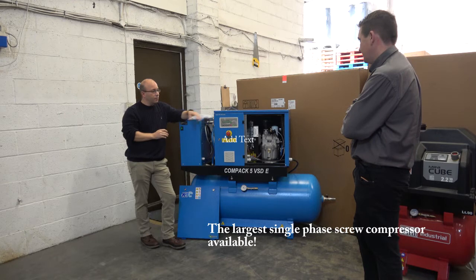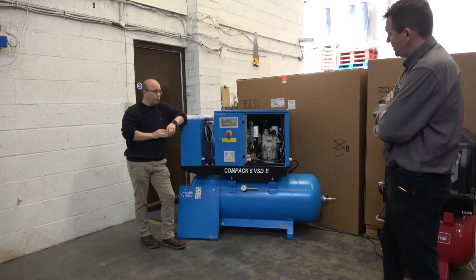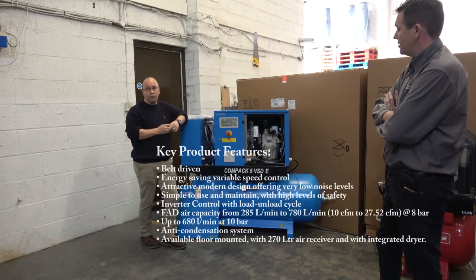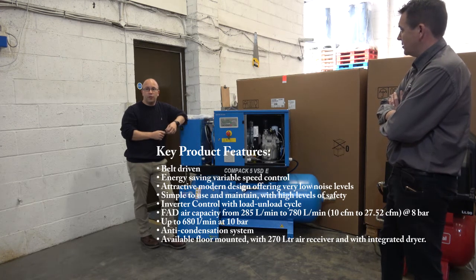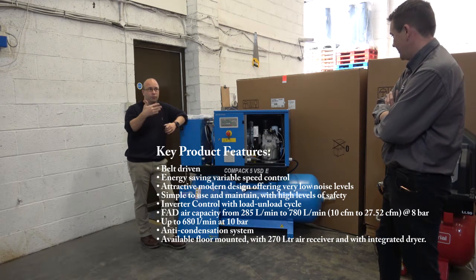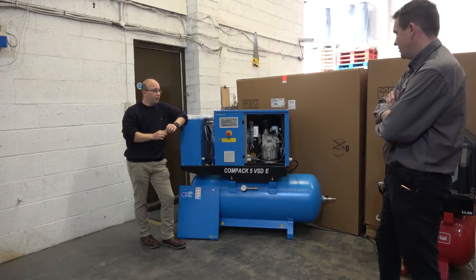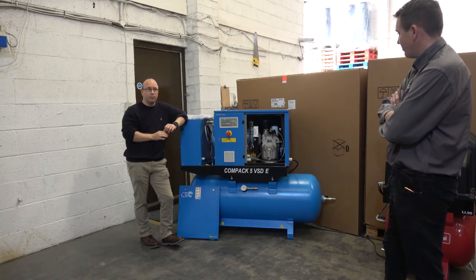It's been reliable so far, no problems at all. The only issues I've come in contact with these machines is where people have not followed the electrical installation guidance we've set out. It's all well and good saying you'll give a 32-amp supply, but if you try to put it down a tiny cable, it's not going to work very well. We set out what size cable needs to be, et cetera. But as a product goes, I've been very impressed with it, and the feedback we've had from end users where we've commissioned it has been very, very positive.